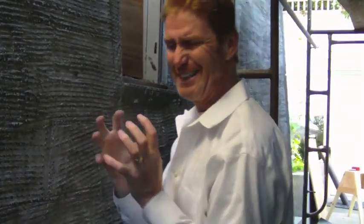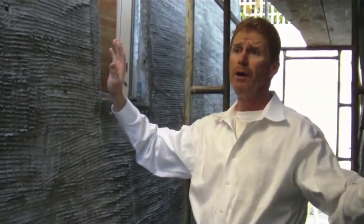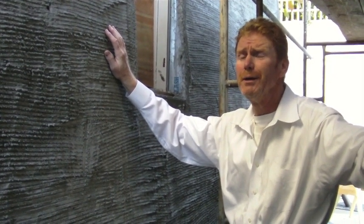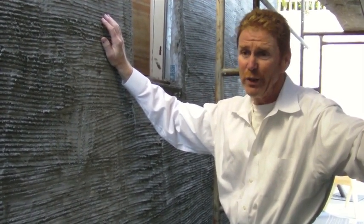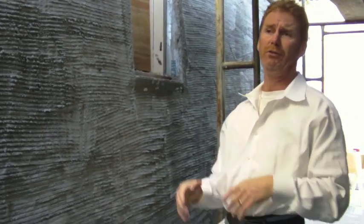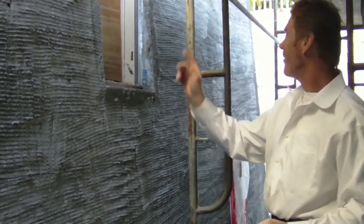We're going to wet the wall and push it tight to give some kind of mechanical bond, because they didn't do very well on that. Down here there's wires sticking up all over the place and there's areas that weren't scratched — we're going to correct all that. The fellow did this job two months ago, then another contractor came by, bid the job, and the owner hired him because he was charming. They called me back last week after it had been sitting for six weeks. He called and said they messed up a lot of things. I couldn't help but say, at least he was charming.